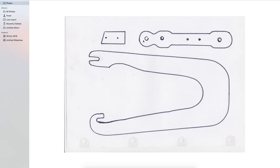You'll need 3 bolts to go through here, and I suggest you use stainless steel with a stiff nut. If you can't find a stiff nut to go with the bolts, put some Loctite or something on them. But do not tighten up these nuts and bolts, because we want them loose. If you tighten them up, you'll squeeze these pieces together and they'll foul, and you don't want that to happen.